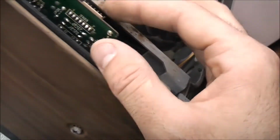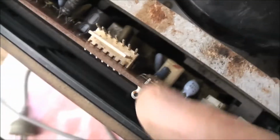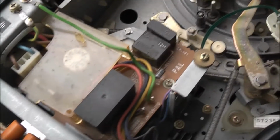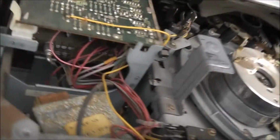But this vacuum fluorescent display clock, that screen's not working. Okay, something's been unplugged there. What, if anything, was plugged in there for the clock? I would say it's just a part tuner. Someone's unplugged something from there and here, but I cannot see where that would have gone. That could have just been optional extras. So I'll take this machine apart and have a quick look just to verify. Yeah, just not having a schematic.